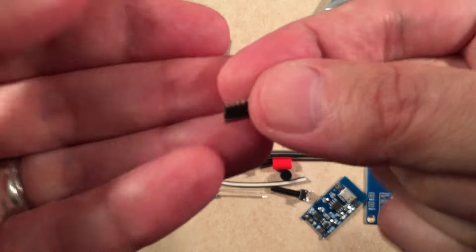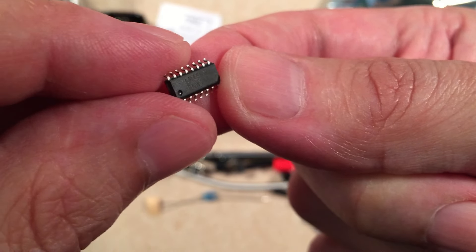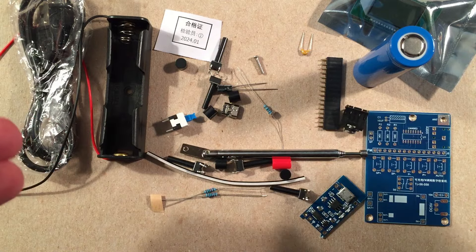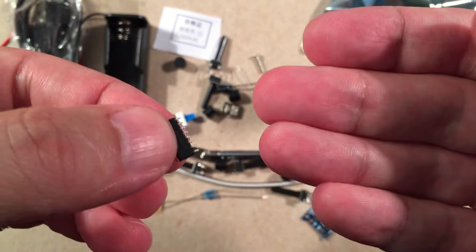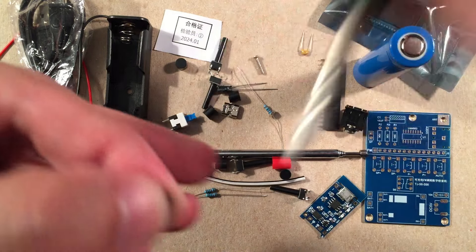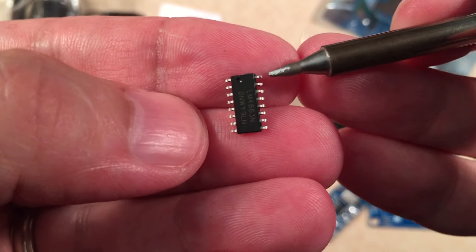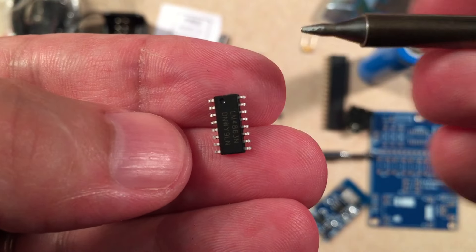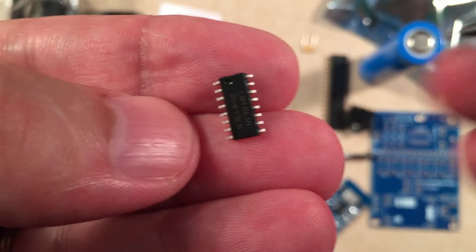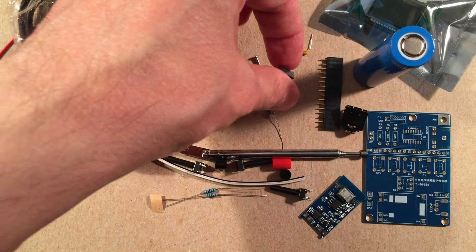That's our audio amplifier — it's going to be fun. What I'm going to do is the drag soldering method. I'll tack one leg down on the board, take some solder on the point, and drag it across these legs. If there are any bridges, I clean my iron really well, get it dry, and just take the point and draw it through to draw any bridges away — the solder will stay on the legs and remove from between. Everything else is through-hole components, so this surface mount IC is probably the hardest part of the whole build.